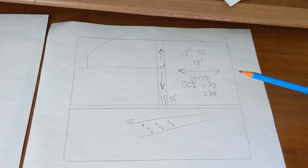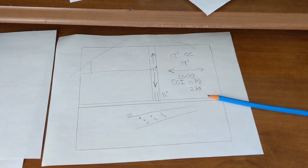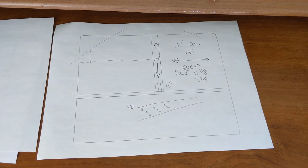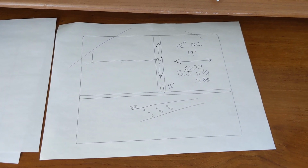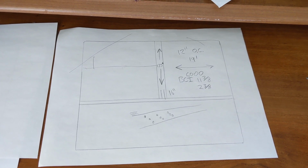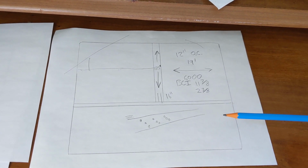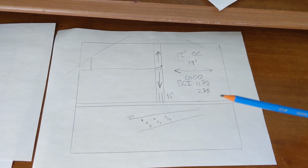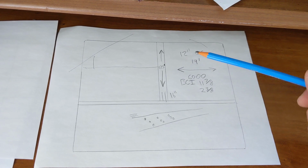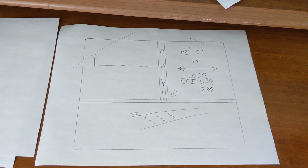Their computerized engineered spec sheet gives it a very good deflection, which I believe is over a 500, which 360 is like minimum, but I typically like to be over 480. And this floor I think might even be close to the 550, 560. Anyways, it's a very solid floor, feels great. 12 inches on center, not fun necessarily to work with after the fact for drilling holes and doing any kind of plumbing. So make sure that your plumbing and electrical are thought through.